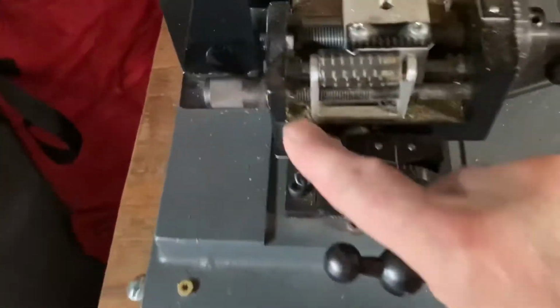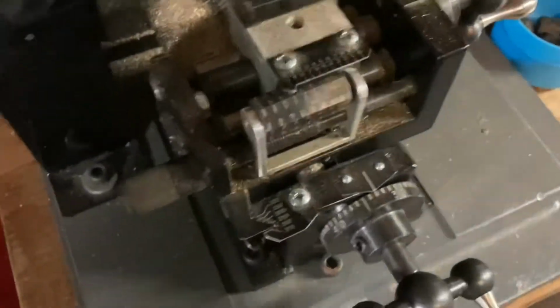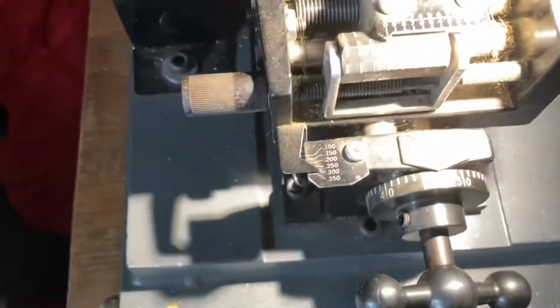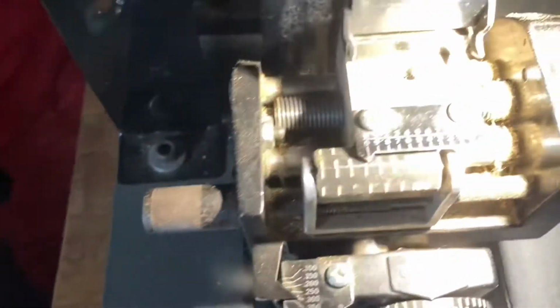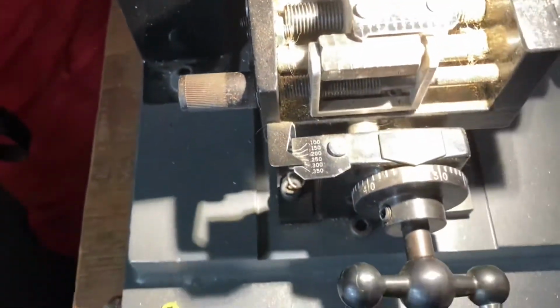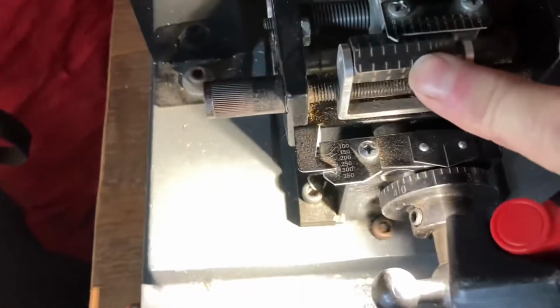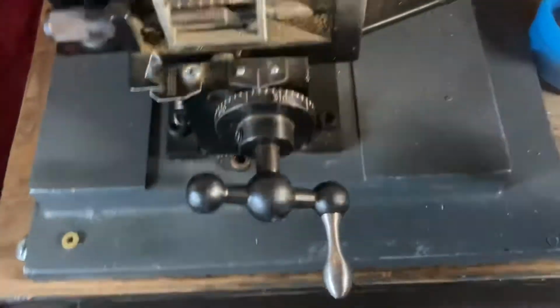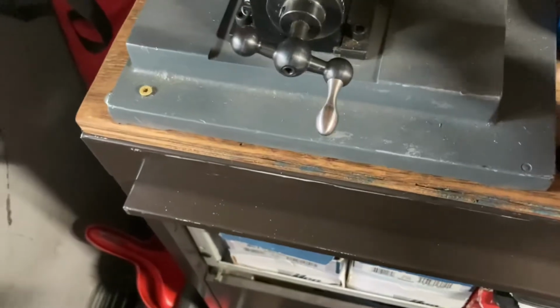I'm going to grab my flashlight. It's easy to kind of get lost on where you're at. Dust off. And so you have to know your blocks. What I may do is scribe some marks next to the marks that are already on there for the 0.150, just because I want to know, when I widen the cut for a Quickset, how much it ought to be. So anyways, that's how those are.